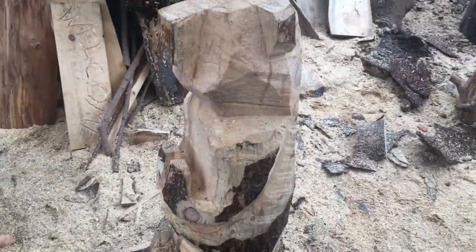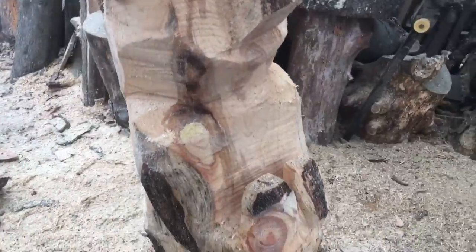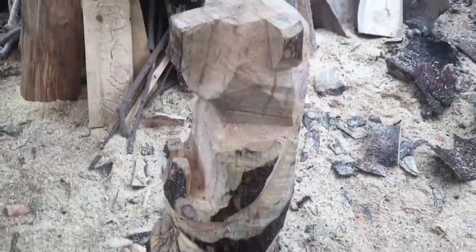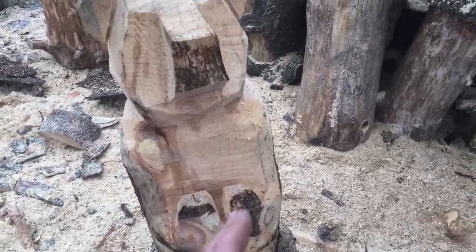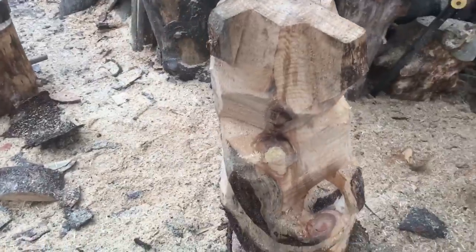Alright, real bummer — I thought I'd turn the camera on for those last few cuts I just did and apparently I did not. I'm going to spin this around and you guys can see where we're at. Here's the bear roughed out — give you guys a walk around so you can kind of see all the angles. I've got my paws ready for my sign to go in. Lower legs, mostly feet and gut. There's ears in the back. This is kind of angled in just a little — I don't want to take too much away from the back because that supports it from falling over backwards. What I'm going to be doing next is pulling out the 193 to make some cuts for the toes and claws, making more rounded shapes, cleaning up the ears, the eyes and the snout. Then it'll be time for the 170s to do the detail work and the fur.